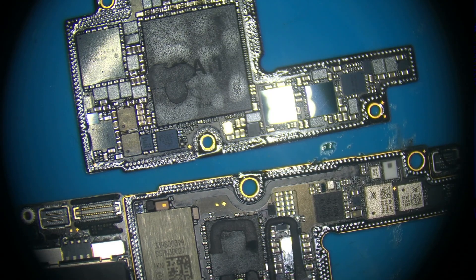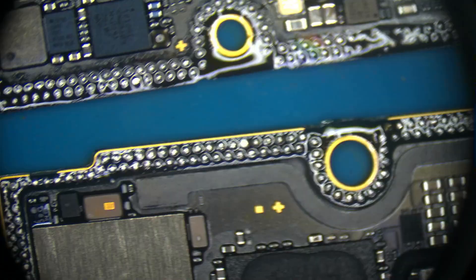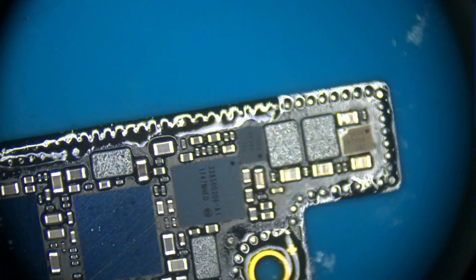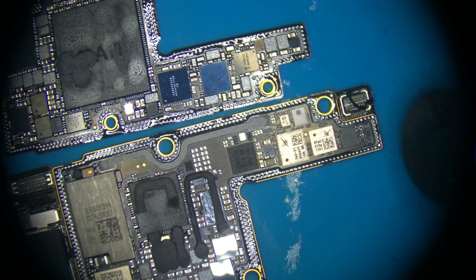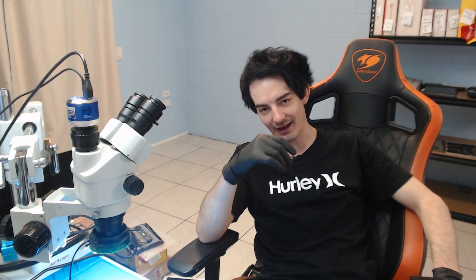The whole purpose of using the screw to remove it is that if we come in and have a look at these pads, you're going to see that they're all nice and even. There's not an issue with anything along here, and because of that we can now work on the iPhone X without any issue and then put it back together without needing to be re-balled. The extra thing I'll mention is remove the thermal paste. If you leave it in there, you'll have dramas putting the sandwich back together perfectly. You'll end up with a phone that doesn't turn on, doesn't have touch, wifi, Bluetooth, et cetera.